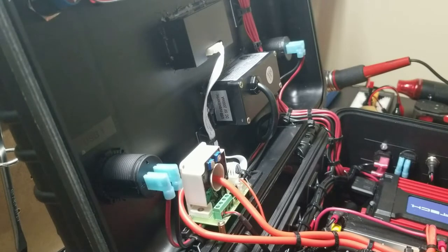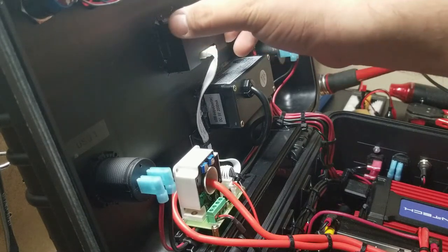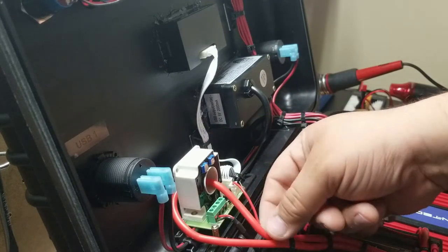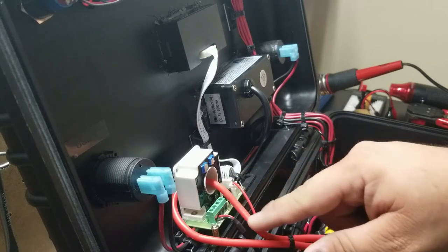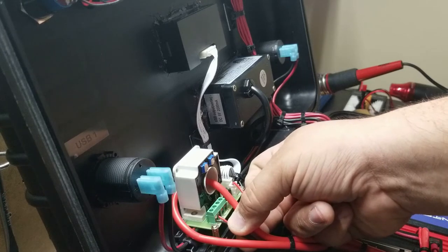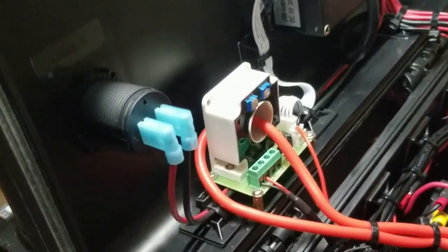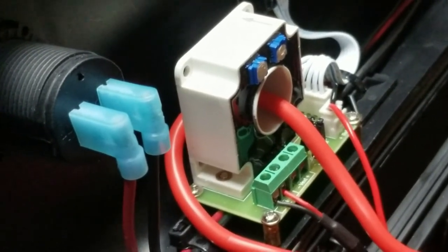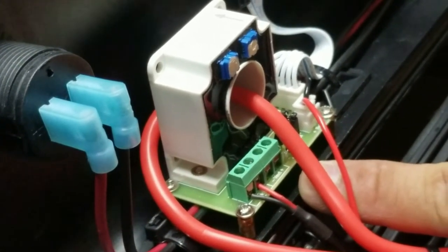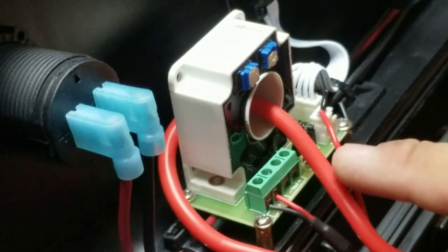So the next thing we're going to look at is this Drok multimeter. There will be a link in the description below for this one. And so this is the meter here, but the brains of the operation is actually this CT. And this Hall sensor, what it's doing, it's measuring the wattage or the current moving through this cable. And it's also controlling the relay. This is the relay circuit right here. Let's get a closer look at it. That's the relay circuit right there. And on this side, we can also use external voltage to energize the whole thing. But we're using this wire here to energize it. And that way, this one is also used to measure.